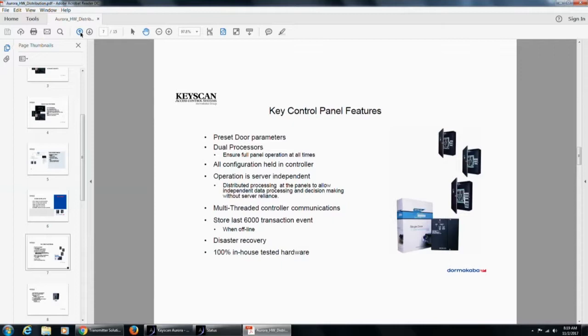A backup will store 100% of your database. I always say that, again, a database is everything. Pictures, maps, configurations, labels, that sort of thing. The panel, of course, will not store that information. So if you recover a panel, you're recovering approximately 30 to 40% of your database, essentially, because you'll have to go back in there and add some labeling, add your maps back into the system. You'll have to re-register the software. So there is a difference in what that is, but worst case scenario, we can at least start from 30, 40% of your system, what you had, as opposed to starting from scratch and having to reconfigure everything in there as well.